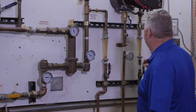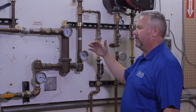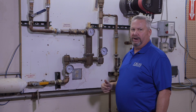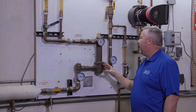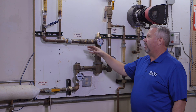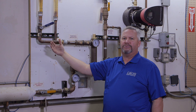First, we're going to want to turn off the recirc pump because we don't want that recirc flow to influence any of the incoming water. We also need to create a demand on the system that is greater than the minimum flow rate of the valve. This valve is an 802 mixing valve, so our flow rate out of the system needs to be 2 gpm or greater.